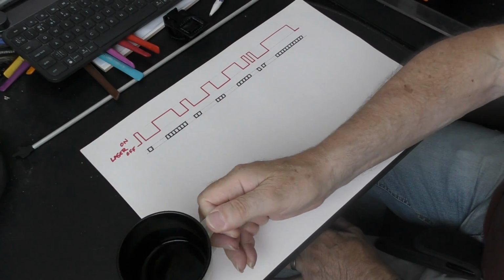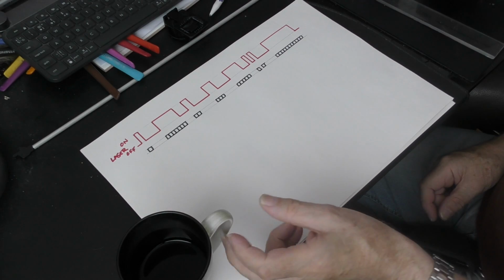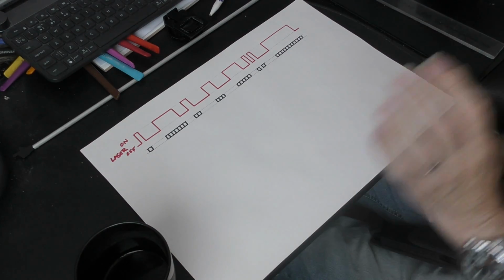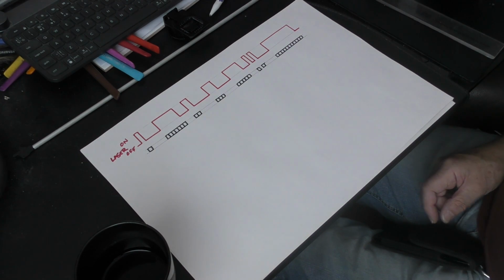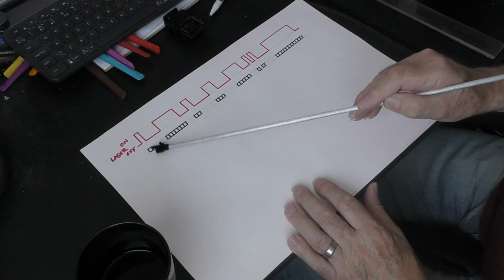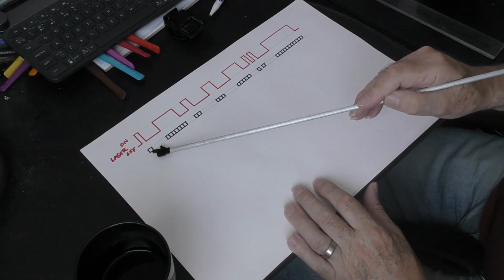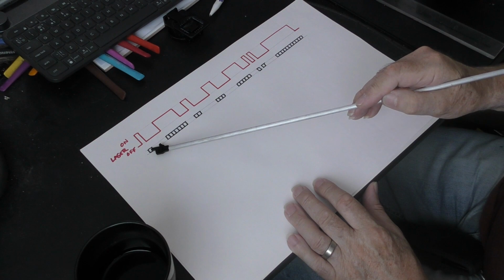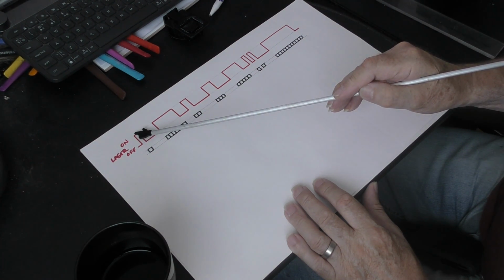Right, just need to lubricate my two grey cells. We're sending a bitmap down to the controller, and the controller knows where every single pixel is in your image. So when you start doing your scan, the controller knows where that pixel is. And when it recognizes the coordinates for that pixel, it says, ah, there's a pixel there. Turn the laser tube on.